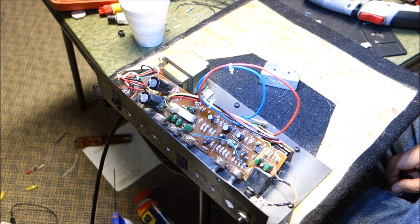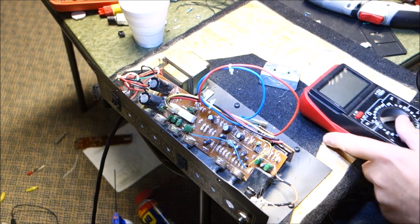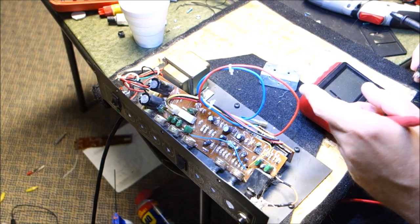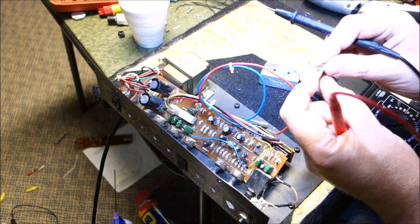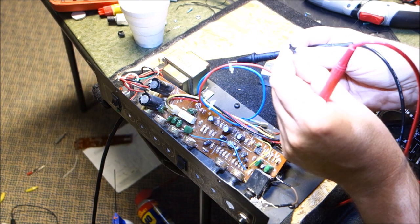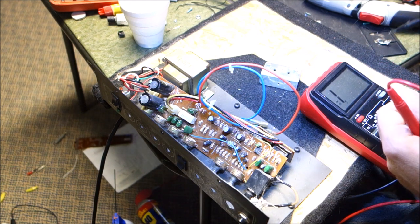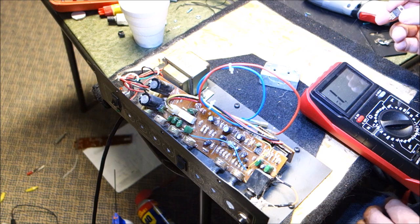Last time we looked at this I'm pretty sure the fuse was blown. Let's check — the fuse was blown. The fuse still is blown. And the TDA module and its heatsink were missing, but they found them for me. This heatsink — normally they're covered in thermal compound, but this one is covered in weird magic snot, like it was glued on here. Some kind of adhesive, all stuck between the pins. Maybe that just went conductive and caused it to blow up. That was a TDA 2030A. I have a TDA 2050 — that should be close enough.